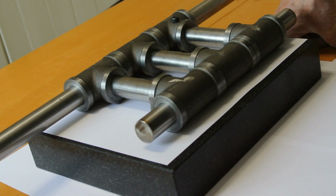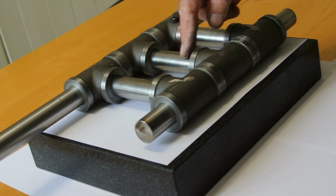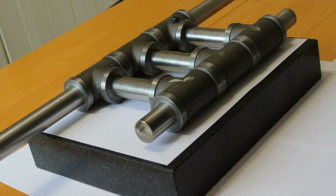I don't care for trying to drill this out, because this is quite hard steel. This is a bit of scrap EN24T which I had left over on that, and this is 304 stainless. I used stainless in here just so that there was no chance that the column could rust up, although of course the sleeves could inside there, I suppose.